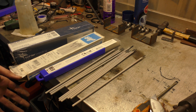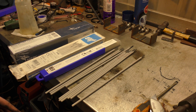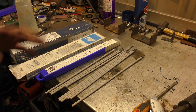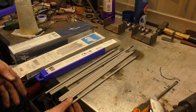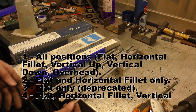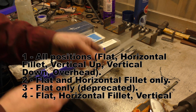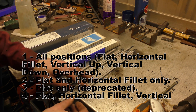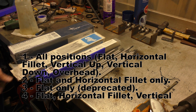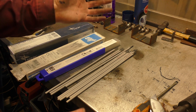What do these numbers mean? The 60 and the 70 part is their tensile strength — 60,000 psi and 70,000 psi. I think the one is what angles you can use them at, like straight up and down, vertical, horizontal, and overhead. I don't know, honestly — Google it. You can get a welding rod for everything, every number, every kind.